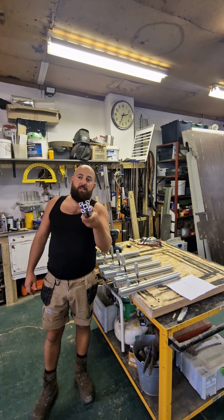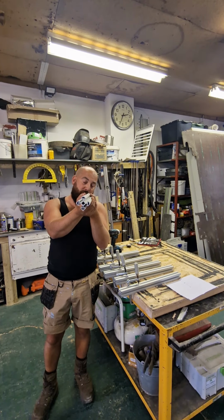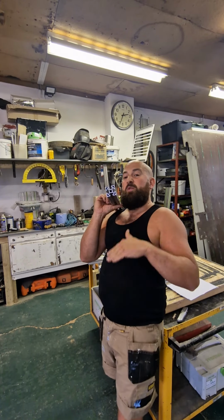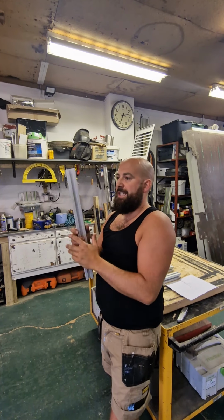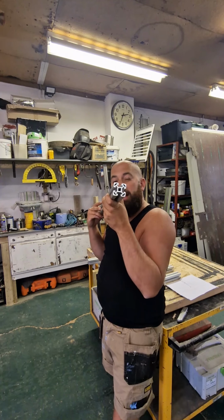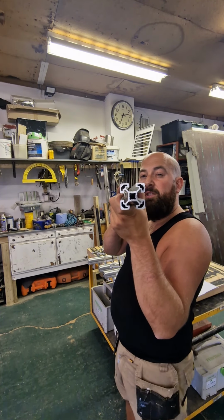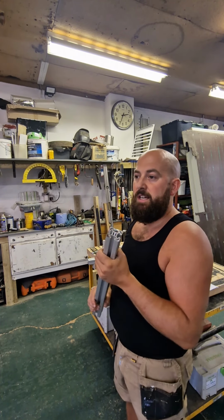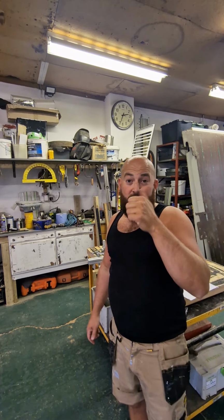Right, so you probably wonder what I've been doing, and I have been threading my new 40x40 CNC distance sort of depth gauge bars, which I'm going to install on the CNC in a minute, but it was quicker to use the impact drill rather than trying to do it by hand. So that's what I just did. You can see that there. Stainless steel screws straight into the aluminium, made my own thread, and now I'll be able to use the Allen key in the CNC. So it's all about the slower you go, faster you go.